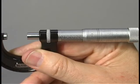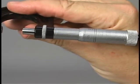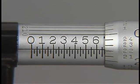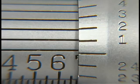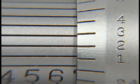To find the correct vernier reading, rotate the micrometer toward you and check each line on the vernier as your eye passes directly over it. Be careful — parallax error can easily result when reading values from the curved surface of the sleeve. Always rotate the micrometer until you find the true vernier reading. A thimble graduation that does not appear to line up when viewed at an angle may line up exactly when viewed directly above.